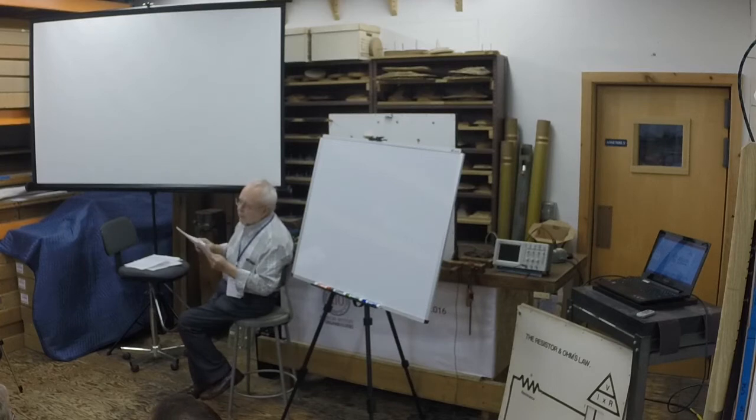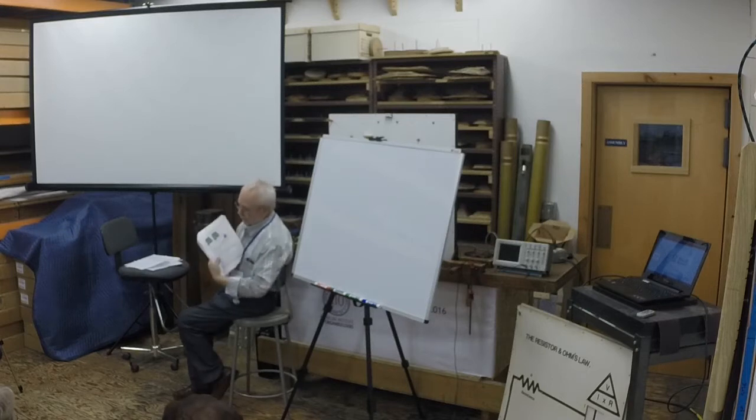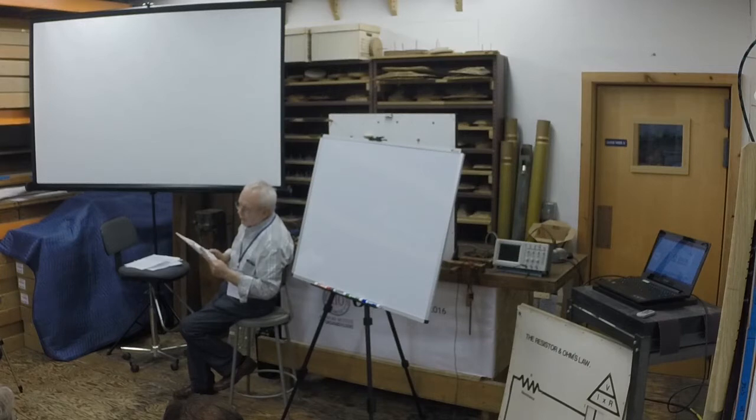To increase the available current, more than one power supply needs to be added. Here, 2 units are running in parallel. There are lots of theories about the best way to do this. The best method depends on the installation and the type of equipment. However, there is one golden rule, it says here. Always join the negatives of the power supplies together with a large, very adequate ground bus.